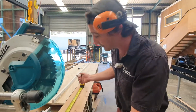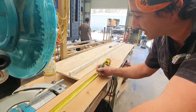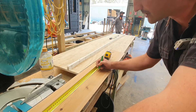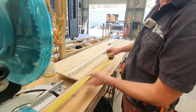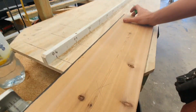So right here I'm cutting some cladding. The best way is a really nice sharp pencil. I'm looking at 3675 as my measurement. Do your line and then always do a little mark coming off the side, which is excess, so that when you go to do your cut, you're not going to cut it too short.